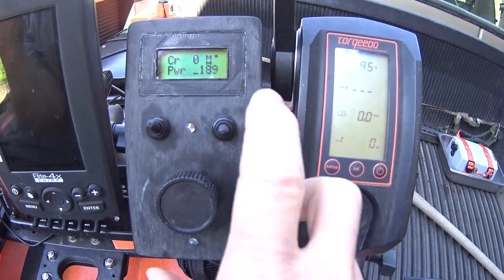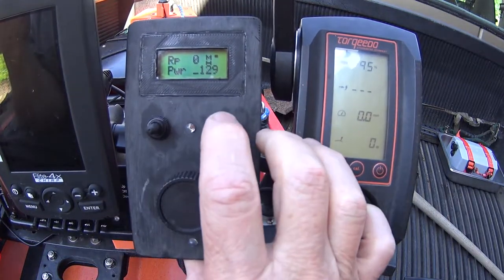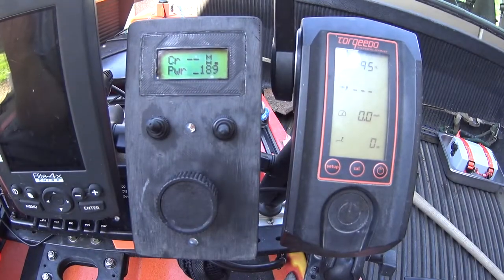I mentioned one of two speed sensors. There's an icon just to the right of the M there, which indicates which of the two speed sensors is active — either high meaning GPS, or low meaning a paddle wheel sensor. Each detent on the knob increases or decreases speed by a tenth of a mile per hour. I found the paddle wheel sensor, when it was very clean, was good at normal trolling speeds. As it got dirtier with all the scum in the Salusala, it became pretty inaccurate below two miles per hour; above that it was fine. There's a separate video just about the paddle wheel showing how it was set up.